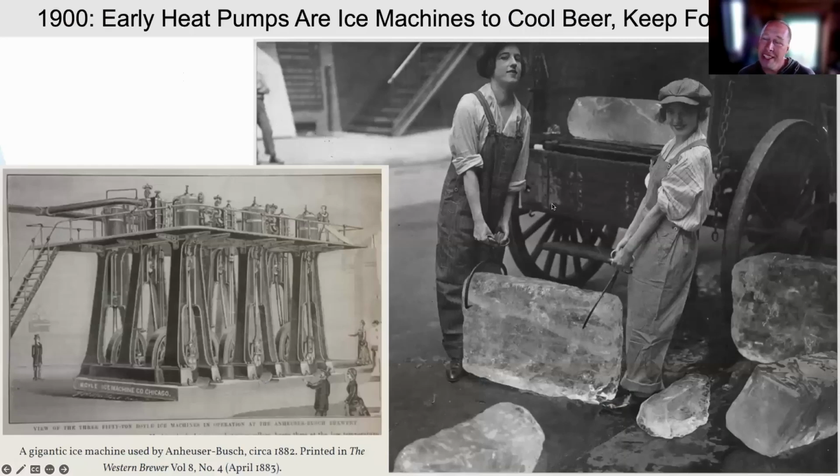I'm going to give a little story time, and then we're going to go into the technology. But to understand, the core of doing an all-electric home is using a heat pump. If you're using electric resistance, then you're not taking advantage of the excess heat that's outside in the wintertime that you can pull into your house for water heating and for space heating.